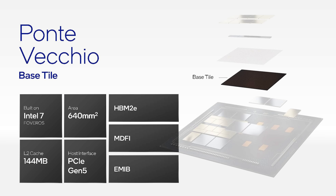That's really one of the big innovations that AMD EPYC brought — showing you can do this in a mainstream server part. Those compute dies have to be married with the Rambo cache and then put onto a base die, which uses Intel 7 — not even TSMC. Also on that base tile, we get a total of 144 megabytes of level two cache. To put this all together, there are two technologies that Intel is relying heavily upon. First is EMIB, which is really die-to-die — think of it as adjacent die-to-die connectivity.